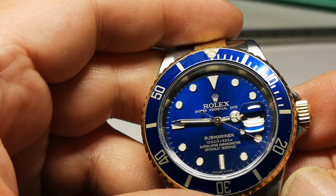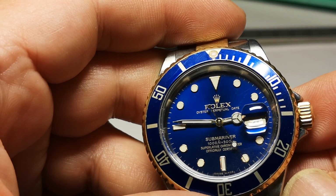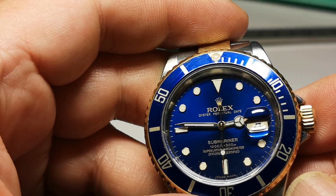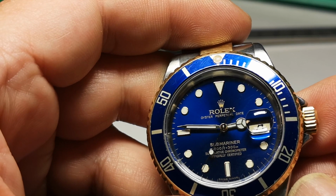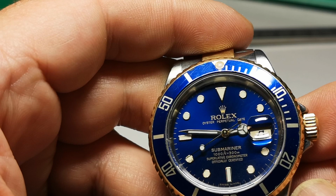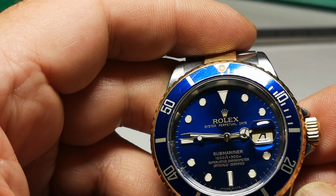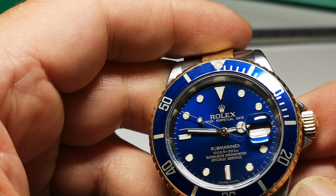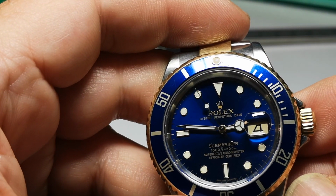Okay, so you've seen a little of the inside of the watch now, the Rolex 3135 movement, and just how beautiful and how functional that movement is. And you've seen a little of the keyless works and the calendar wheel, which is held tightly with a lever which has a rotating jewel at the end of it, and all of that makes for how I would characterize the keyless works on this particular reference, and that is that they are solid and they are smooth.